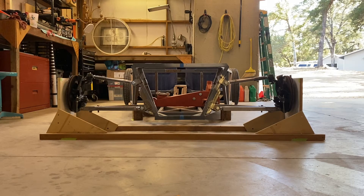They're tacked in - ended up about eight degrees slanted inward, slightly different than what v-susp said, but maybe I just couldn't measure perfectly. I think it'll work. It should just about hold wheels, so I'm going to take the jig out and put some wheels on it.